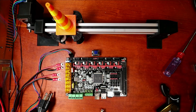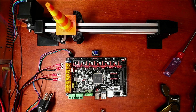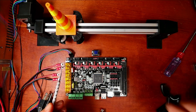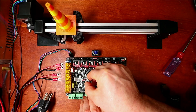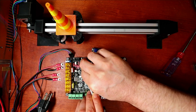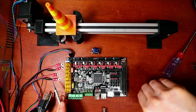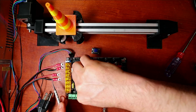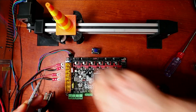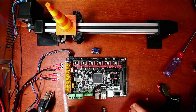I'm only going to do the x-axis to show you what's occurring. Currently it's set up for SPI with all these pins, so what we need to do is remove these jumpers over here. The UART is actually two pins located right over here.